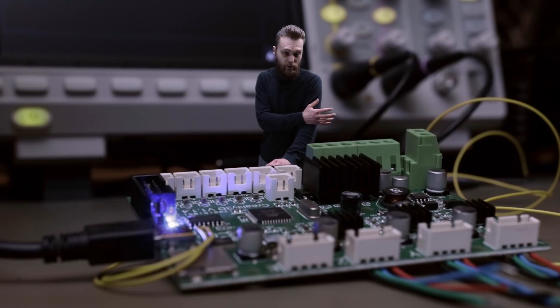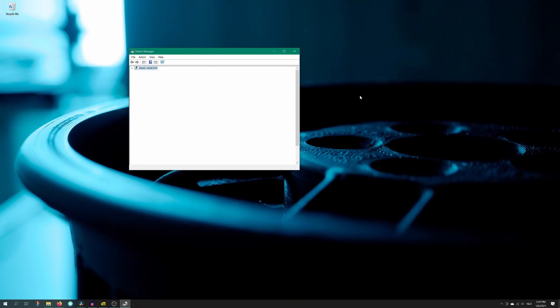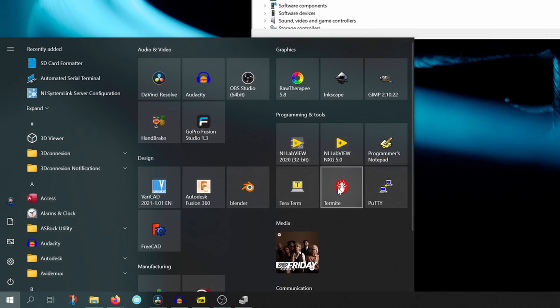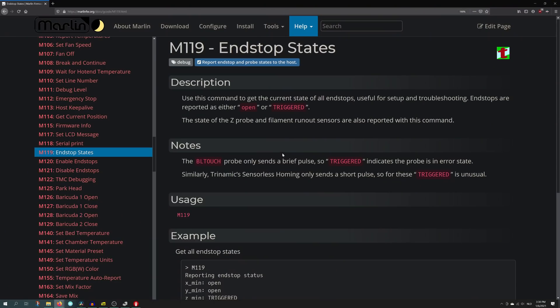What we receive back from the microcontroller, we can see with this oscilloscope — the ones and zeros — and find out what message is sent and received. If I connect this mainboard through USB to my computer, you can see that the serial port appears, and in my case it's COM5. We need a terminal to communicate through a serial port. These three are used a lot, and for this example I'm going to use Termite. We have connection with the printer, and you can go to settings, set it to the proper COM port, have the baud rate correct, and now we can send some commands to this board.